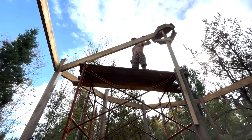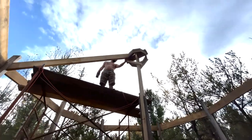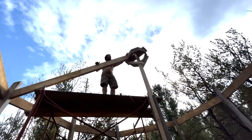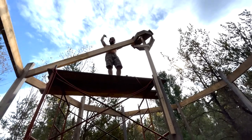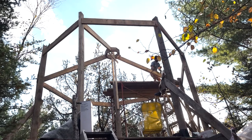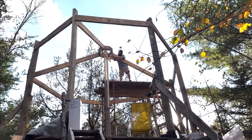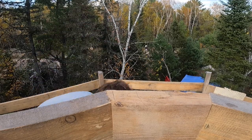Like 22.5 right on the knob. Oh boy. Well, that's pretty exciting. Some finessing, I tell ya. But not too bad, honestly. You just set the angle of the saw, and then you go to that 22.5 and zing. Level looking up.